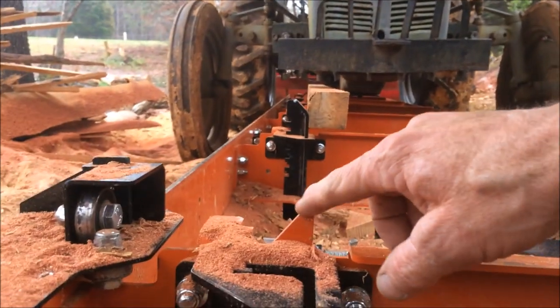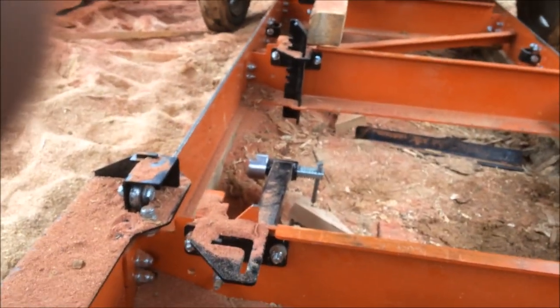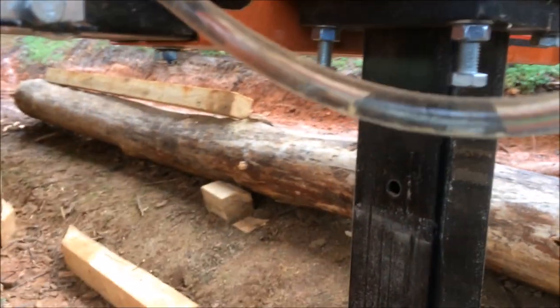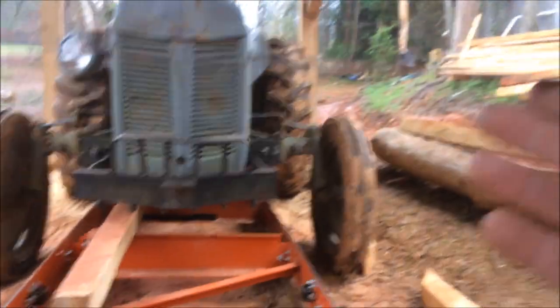I took the little nuts they had on the bottom of the guide on this side and put a really flush carriage bolt in there so I can cut right down to three quarters of an inch — that'll let you clear the heads here. It's right between three quarters and seven eighths, so you don't have to cut a one-inch cut on your last one. Also, make sure you set your stops on both sides once you get your height distance right. Measure and set your stops on both sides so that when you drop it all the way down, the blade to the bed is the same distance on both sides. That way you get a good square cut.